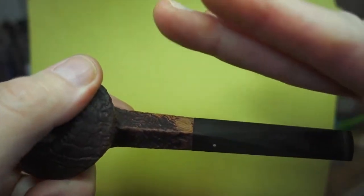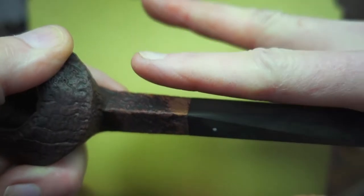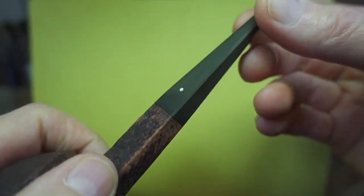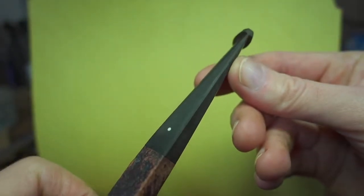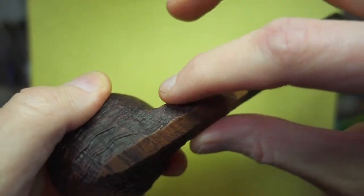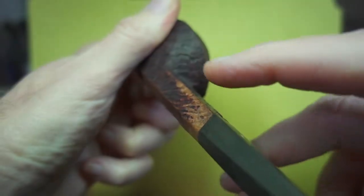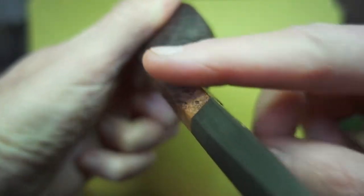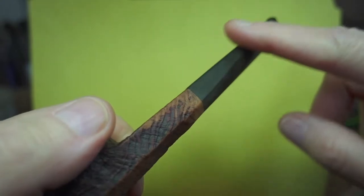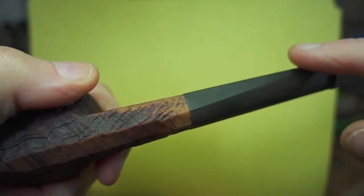When I say adjustment, I mean moving the entire plane like it's on a hinge up at the button end. There's one spot here that I might lower a couple thousandths of an inch, but the edges are still long, skinny rectangles. That needs to be rolled over so that the approximation of this through here is more blunt — it's not a knife edge — and you want this to mimic that.